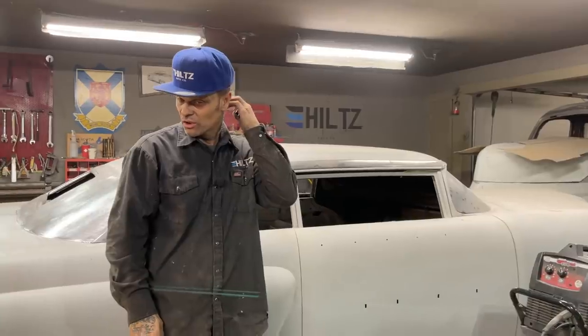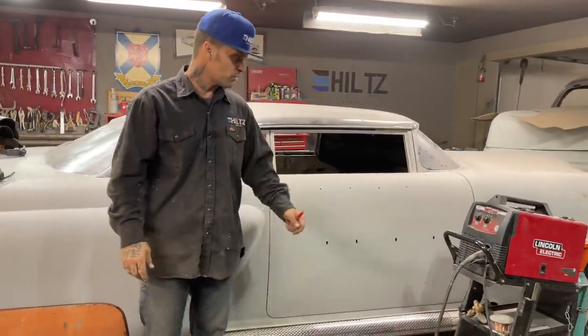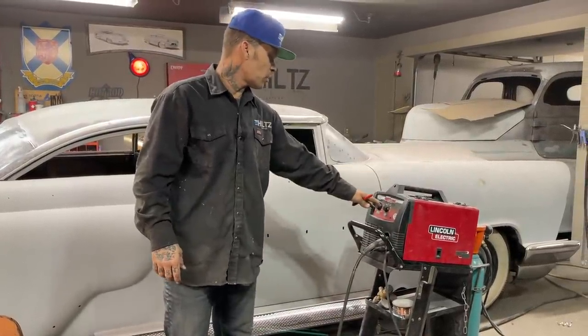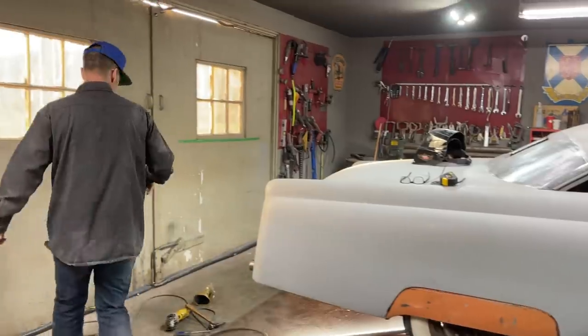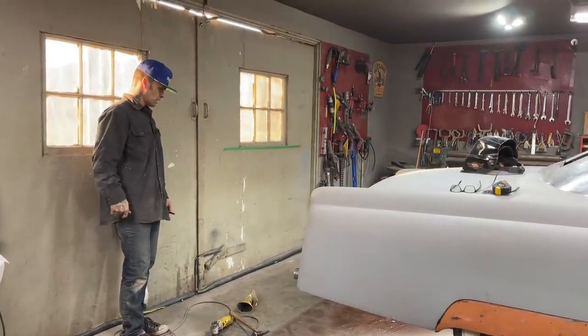I hope that gives you a little bit of knowledge on what's going on when you turn your MIG welder on. I'm welding on a B or a C. On the 220, I'm welding on the B. On the 140 MIG, I weld on the C. My wire speed generally is the same. I like quick heat, and that's the way I do it.